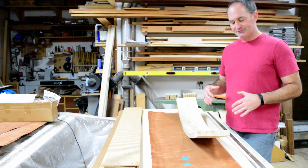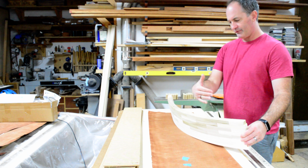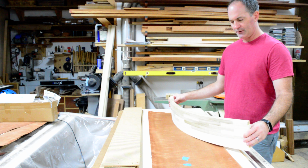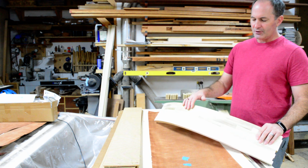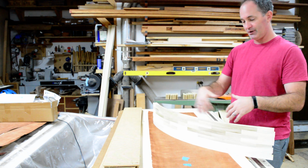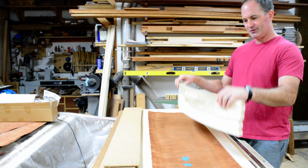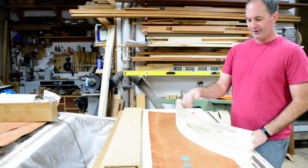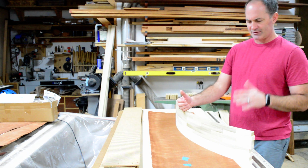Hey, good woodworkers. So, getting prepared to veneer our curved apron for the demilune table, or whatever curved pieces you would need. Just as a reminder, after I got the glue ups done, I used my bow over this curve, tracing off of my full-size drawing, took it here, trued it up on an edge sander. Once this matched my full-size drawing once again, then I offset this to whatever thickness I want. Here I'm going somewhere in the neighborhood of about 7/8 of an inch.